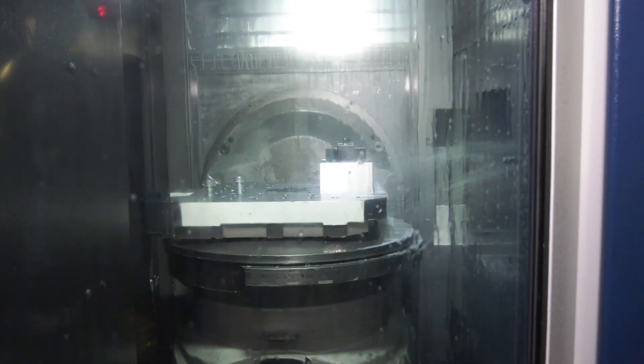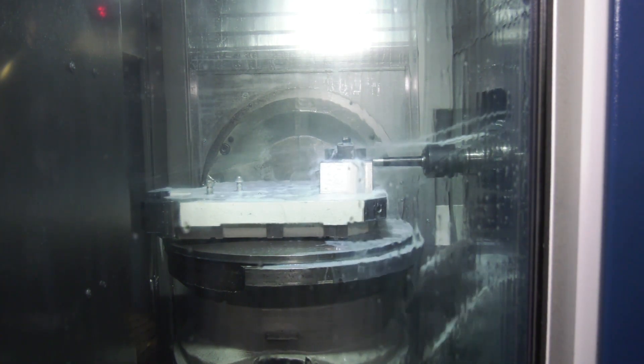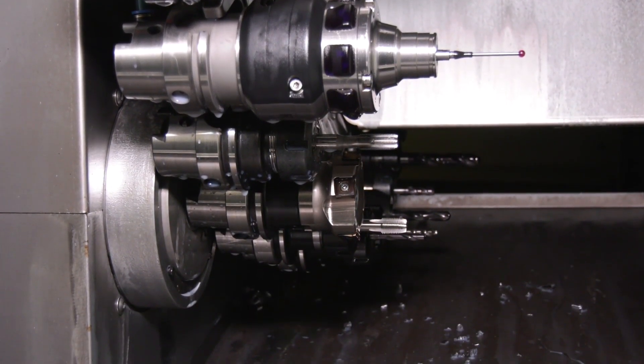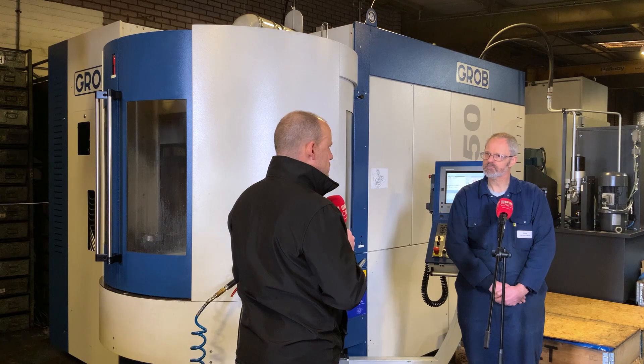It looks like a compact working envelope, but you can get a bigger job on there than you'd realize. With the spindle configuration going up inside the tunnel, you don't always have very much overhang — you can use very short tools. It's quite a compact spindle nose with regard to getting over the top of the pallet. So far it's proven really, really beneficial.